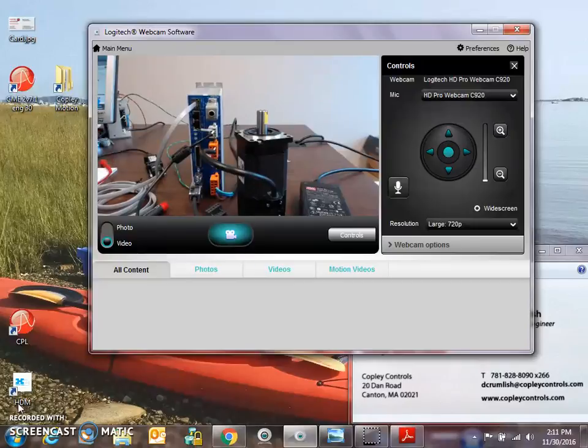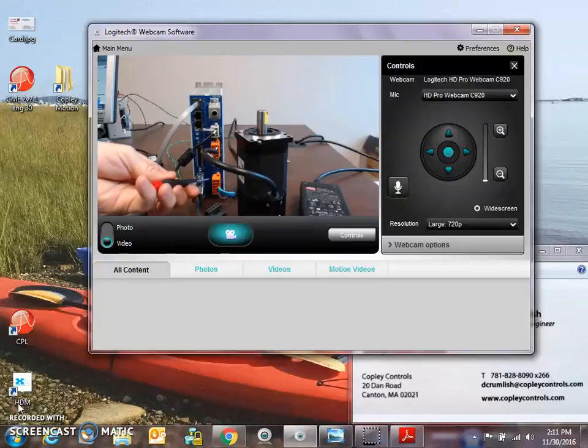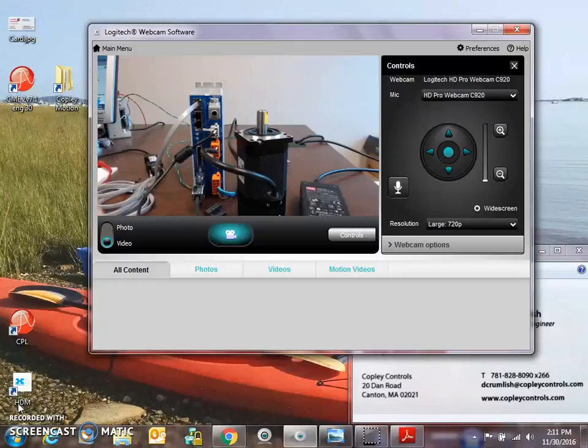So this is a good setup for low noise. You won't get corrupted feedback data. You won't get the CRC fault on the feedback. Yeah, the switching noise will find a path to the case. That's good. If you did have a shield on your power cable, there is another ground connection for a shield there. Ground for the motor.